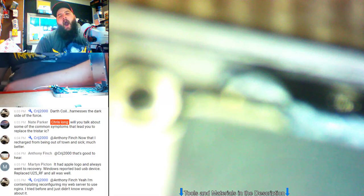And I did. I tried to set the screen. I'm only plugging in just the digitizer and LCD part, connect FPCs, and I've tried both. Does it show the Apple logo at all? No, it's just black, no backlight. Is there an image on the screen? Let's see. Oh no. This one doesn't kick into recovery, it just tries to boot up and then restarts.